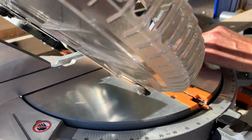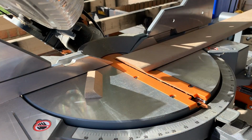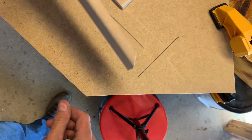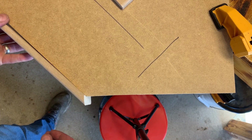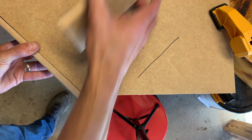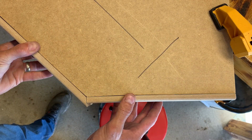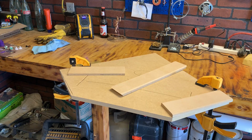So because of the shape of this shelf, I want to start with the center piece of trim. I'm going to go ahead and cut the ends at 45 degrees. And by making those 45-degree cuts, when you bring this to the front, your side pieces won't have to be angle cut, they can just be straight cut. But when you bring the two pieces together, you will see that you're going to have a little bit of extra material on that angled cut. Looks like it's about 1/4 inch.